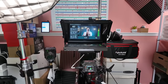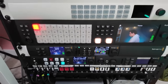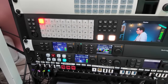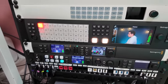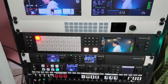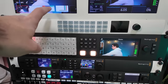So I've got a ton of cameras around here — where do they all go? That takes me over here to the rack. All the SDI cables end up in this rack plugged into the ATEM. This is the ATEM Constellation 4ME HD — not 4K. All the cameras and other video inputs are connected into this thing. I used to use the VideoHub, which is just a router, not a full mixer, and I've taken it out of service for the last year or two because the Constellation has replaced it. However I'm starting to fill up the inputs and outputs, so I may bring it back soon or get a bigger one.